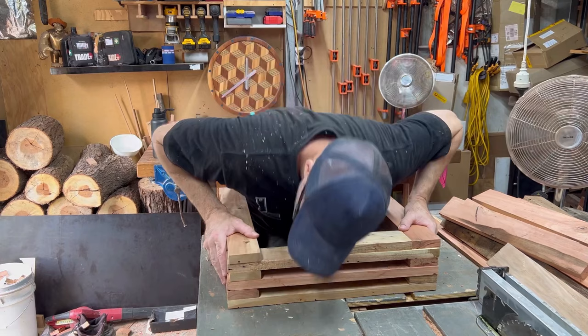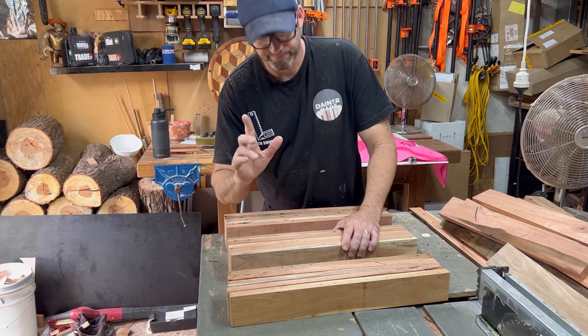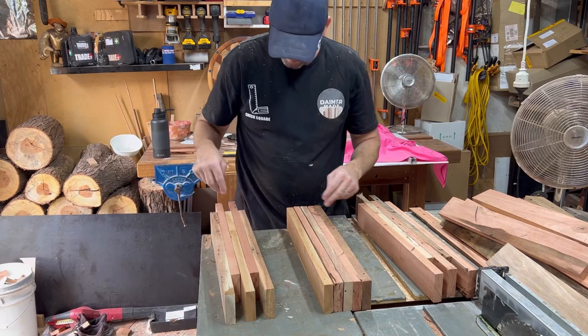You might only want to do three or four layers, and you might have thinner boards as well. Let me go back and figure out how many I need to chop short, and that includes for the legs. I will acknowledge that I am making this up as I go. Here are my two legs, here is my cross beam. On the legs, I need to cut two pieces off so I get the double bridle up the top, and then on the top piece I'll need to cut the opposite short so that they slot in to the fingers.